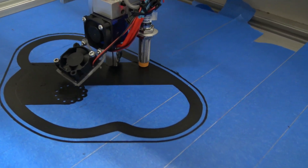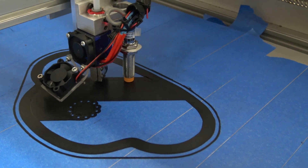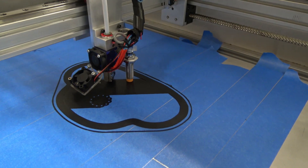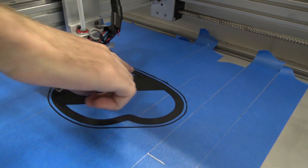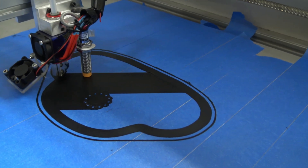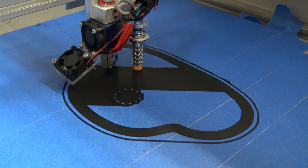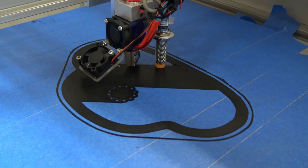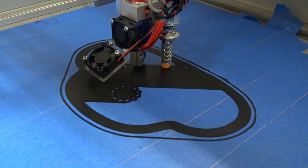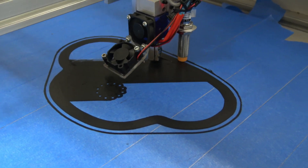We need more extrusion here — maybe up the temp a little? I think we need to measure the diameter. It's starting to over-extrude just a little bit on the very end there — right here, yeah, just a tad. It's probably a slicer thing as much as anything, just because it's meeting at an angle. It always does that on the first layer here. Whoa, now it's looking all smeared out like it's too low — what just happened?